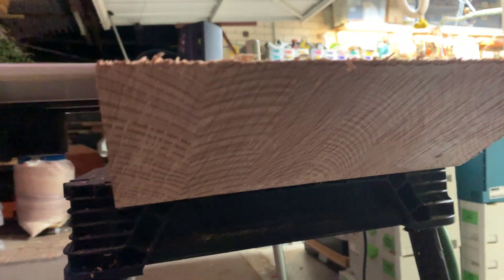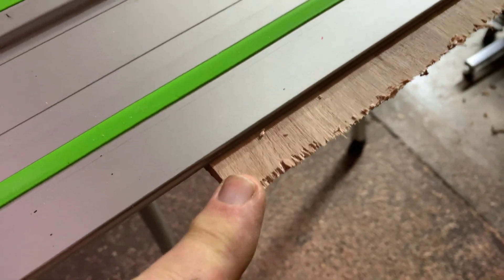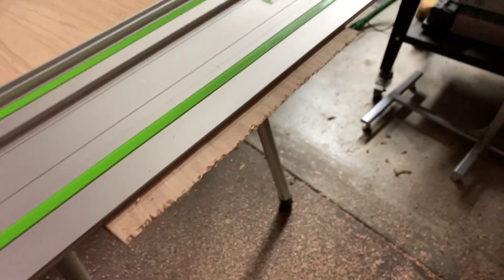This is only cut with the regular blade, and it's chewed it up something fierce. I'm not sure that was what I was expecting to happen, especially with a rail. I thought I wasn't going to get any breakout, but I'm getting severe breakout. I would say if one did it, you'd have to do all your miters first and then plane the top to get rid of all that splintering. Mind you, Vic Ash is a hard timber and it's a very splintery timber by nature.